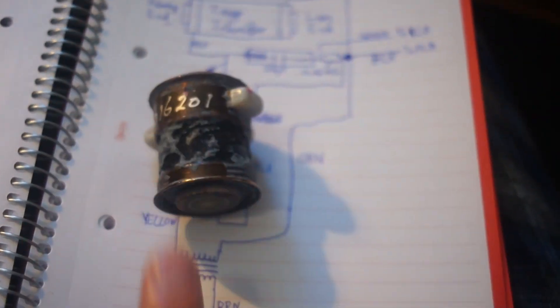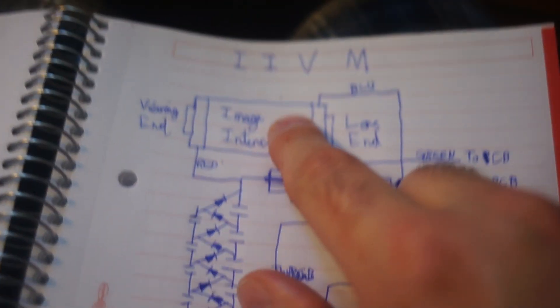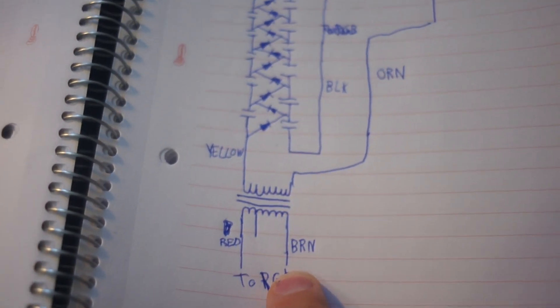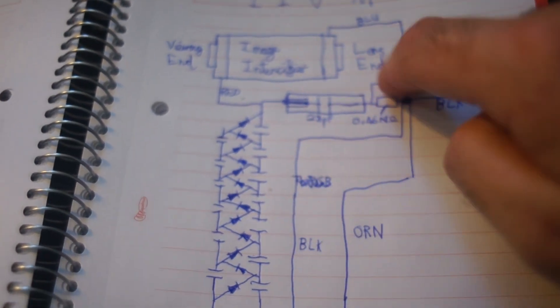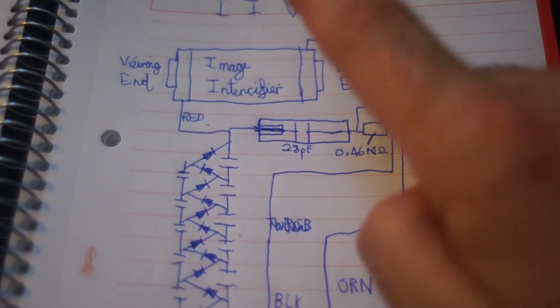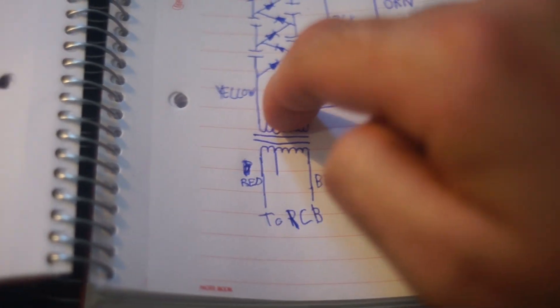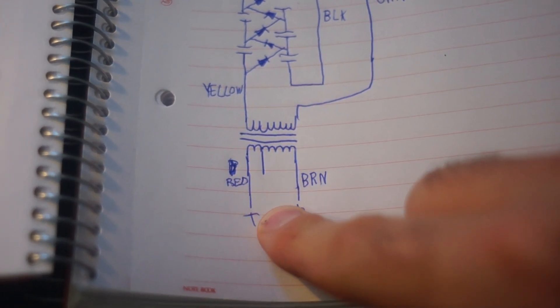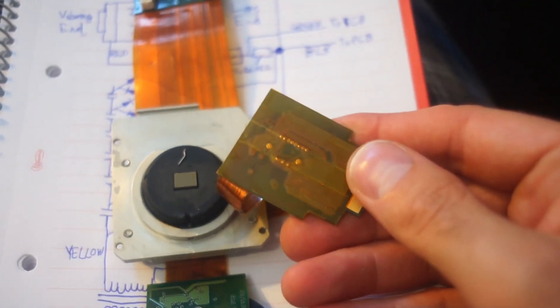It would sit this way round, with this being the top. So that basically acts as voltage feedback. But driving this seems rather too complicated. What I'm thinking is I could delete this whole section of the circuitry and basically hook one part of the multiplier straight to the positive end at the bottom, and the other part up to the top, like it is in this topology. Instead of the transformer, use a CFL driver from an old laptop display to actually power it, because reverse engineering and figuring out exactly what this circuit does is going to be an absolute pain. This is one of those bazillion-layer boards.